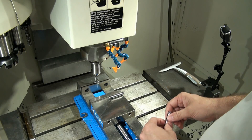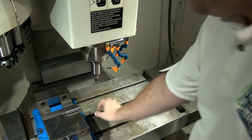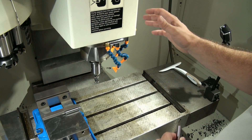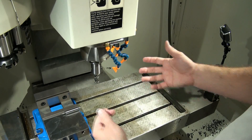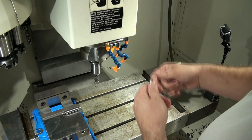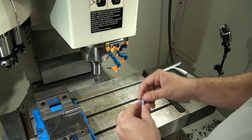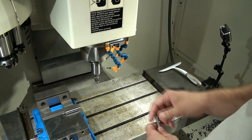However, it does have drawbacks. The biggest drawback is when you remove the vise — say you need to make a part directly on the table using toe clamps — you've just lost your Z reference. You'll have to redo your Z reference, and if you need 20 tools to make that part, you're going to have to stop between each operation and reset the Z height every time. That's not conducive to utilizing a tool changer efficiently — you may as well not have that tool changer.